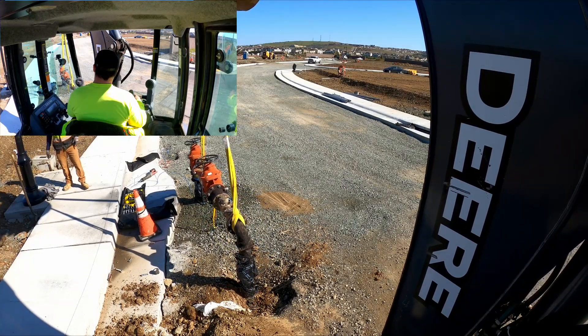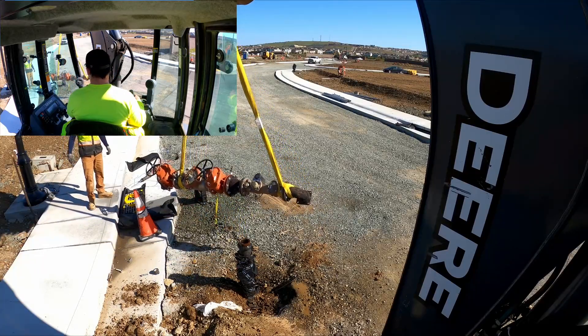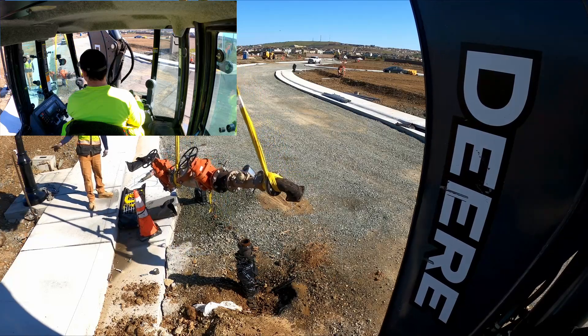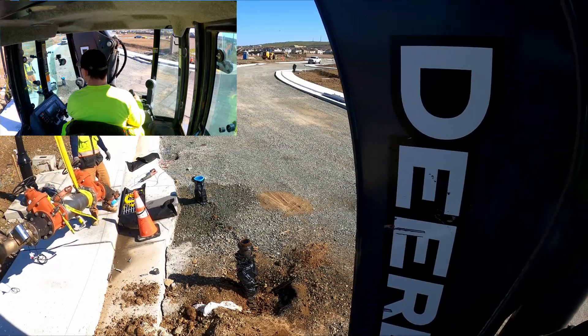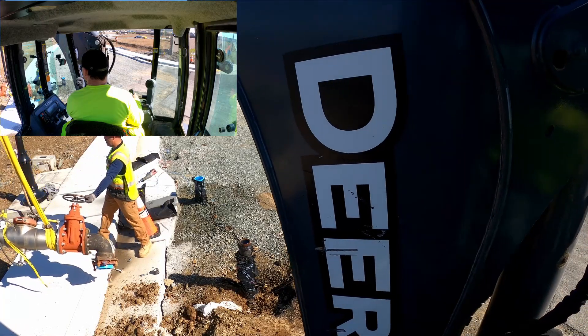Just keep in mind there's always going to be a little bit of residual water left in it, and there's also going to be water in the stand pipes. So always have your laborer — whoever's working with you — go ahead and wrap the top of those pipes, because these are lines that need to be kept clean so you're not contaminating them.